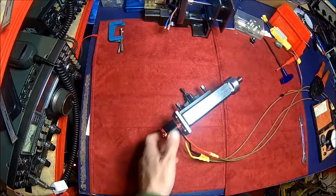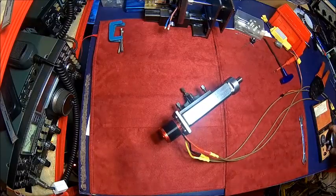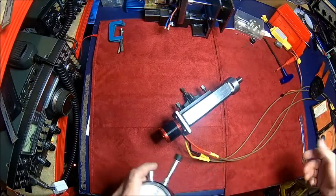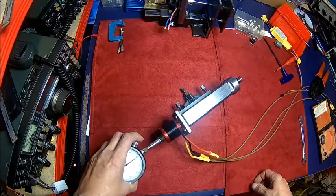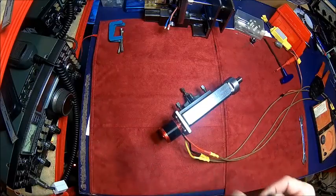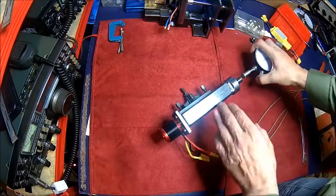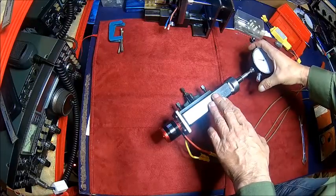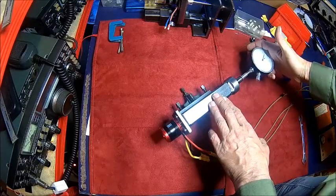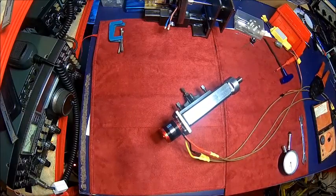Let's spin the toolpost grinder. The motor isn't actually tuned to that ESC, but we'll see if it works. Okay, we got it running. On these ESCs there is a difference between electrical RPM and mechanical RPM, so we're trying to figure out what the ratio is. I think it's an eight-pole motor — actually that's not going to work with that one. So that's 450 for 3000. It's a 16-pole motor, so the ratio is eight.